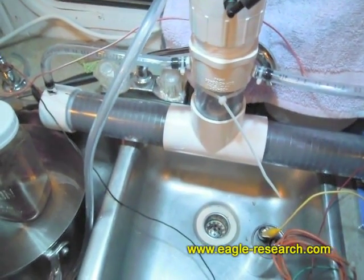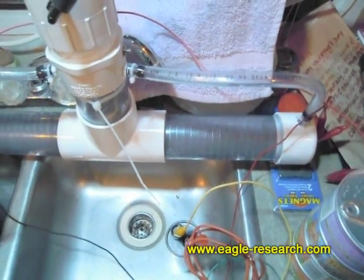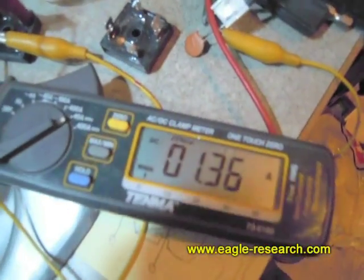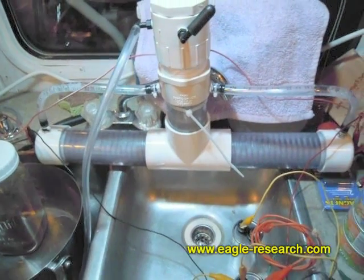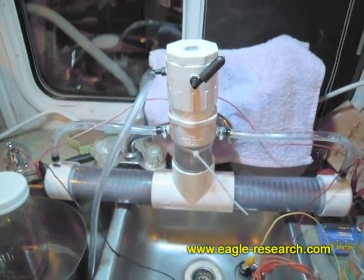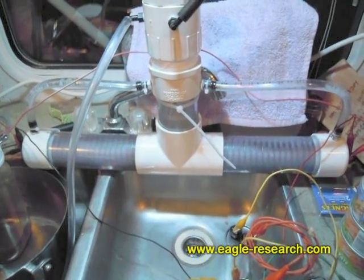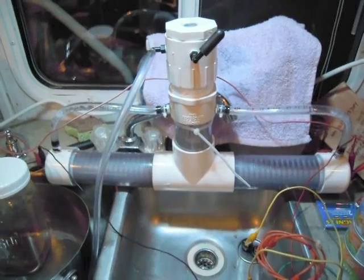If the machine shorts out for some reason, it's absolutely safe. So now we disconnect this and we instantly have our gas production back — we're back at 1.36 amps at 102 volts DC. So that gives you an idea of how the ER50 works for power supply. It's very, very simple. It can be just jury-rigged together, but obviously you want to do a nice job.